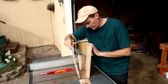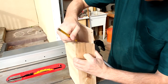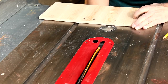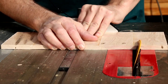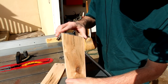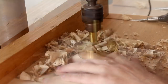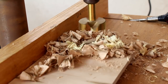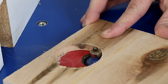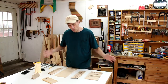Now I'm going to see if I can mark where to cut the sides. I'll tilt my blade to a 20 degree angle. I'm using a 2 inch diameter Forstner bit for the two holes. And I'm rounding over the edges of that circle. Now I can glue all of the pieces together except for the top, which I'm going to cut down to size once it's all assembled.